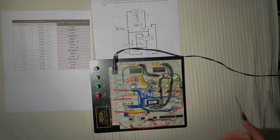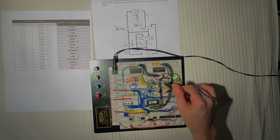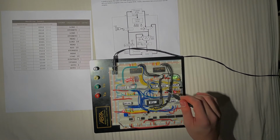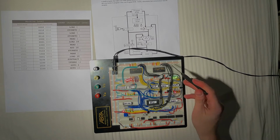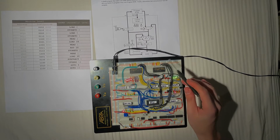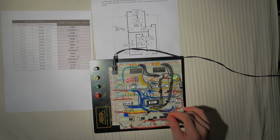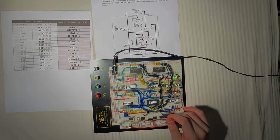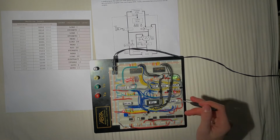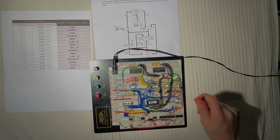To begin, these black wires here from the upper nibble of program EEPROM to the address pins of control EEPROM are for the opcode. These dictate what control codes will be sent out across the entirety of the chump. These opcodes are the I/O pins from the control EEPROM. So these black wires here feed into the ALU, accumulator, and address register. 6 of them go into the ALU through the function select pins, carry in and mode select pin, the accumulator enable pin, and the address register for the read-write bit of RAM, following this data path here.